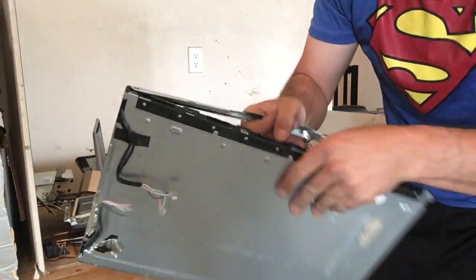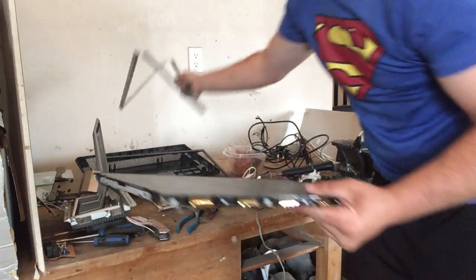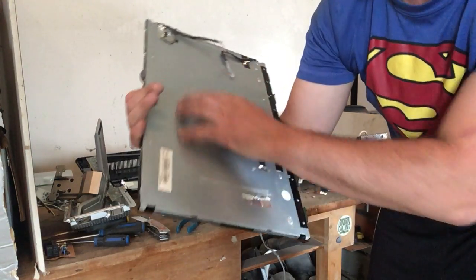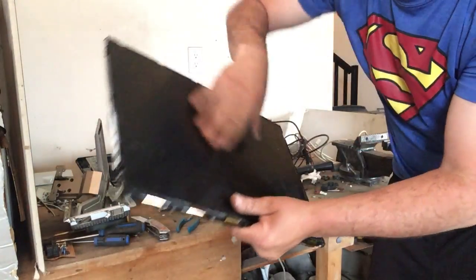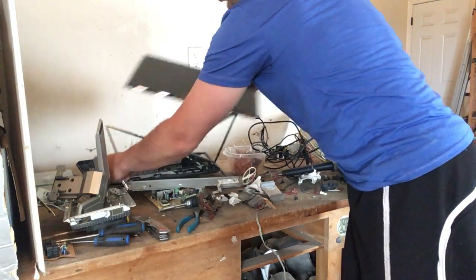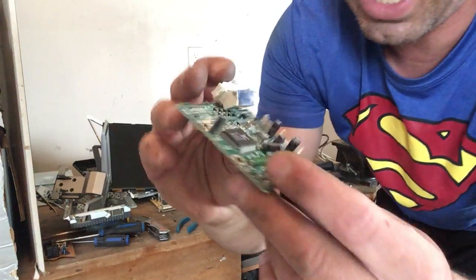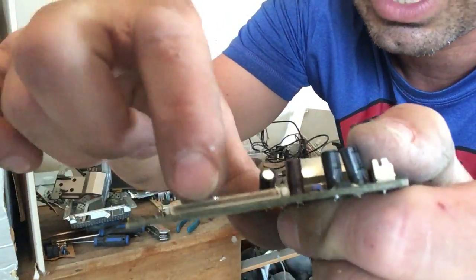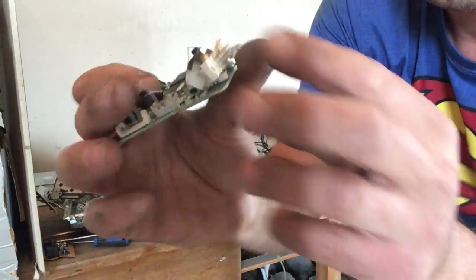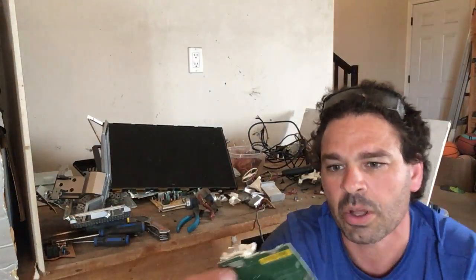The rest of this screen — I am going to remove the frame, which is going to go into tin. The backing does have a couple of pins. Once I remove these pins, I'm going to take this backing off, but leave the rest of the screen to bring in as e-waste along with the plastic on there. It also has a smaller circuit board here. These circuit boards are also valuable because there are some gold prongs in there, as well as MLCCs — those chips are all worth money. You can see the gold prongs — I will actually cut these with a side cutter and put them into a vial.